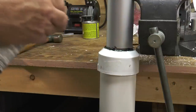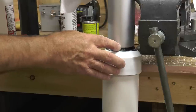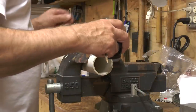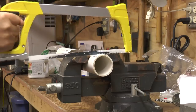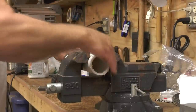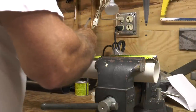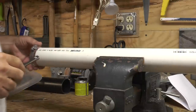Once this is all hardened, it should make a pretty nice seal. Now I'm going to make the coil section, which is just an experiment. This is a piece of PVC that fits inside of the flagpole sections — the first and the second section — and it's going to create an insulated spacer between the two sections. So I'm going to place this into the flagpole and leave just a little bit of space where you'll be able to wind a coil, just for experimenting. I'm going to mark a couple of spots where the PVC will be exposed, and that's where an experimental coil can be wound.